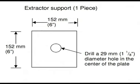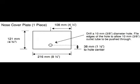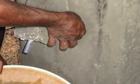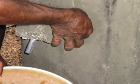Once you have cut all the pieces, drill a hole 29 millimeters or 1 1/8 inches in diameter in the center of the extractor support piece. Drill a hole that is 10 millimeters or 3/8 of an inch in diameter in the nose cover plate piece. Make sure you file the edges of the hole so that you can fit a piece of 10 millimeter plastic tubing through.